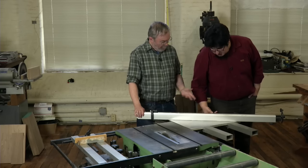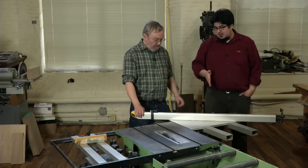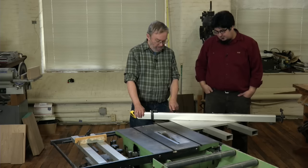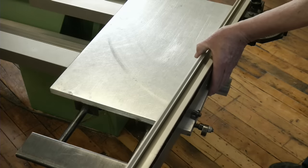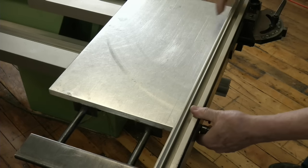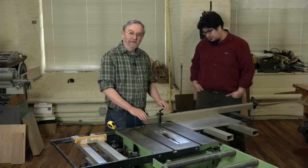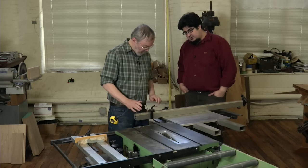There's this cam mechanism over here, so you're dialed in to 90 degrees every single time. That's dialed in so you don't have to rely on just the miter gauge. And it's always very accurate — it hardly moves at all — but it's always good to, if you do take it out, double check with a square to make sure it's accurate.